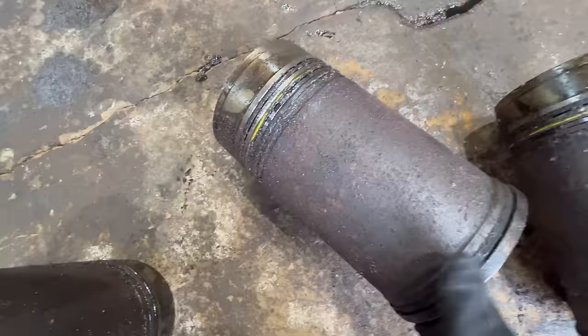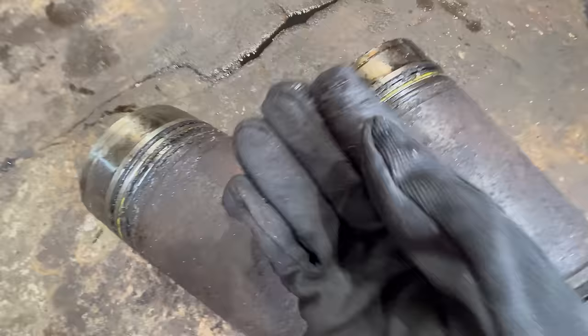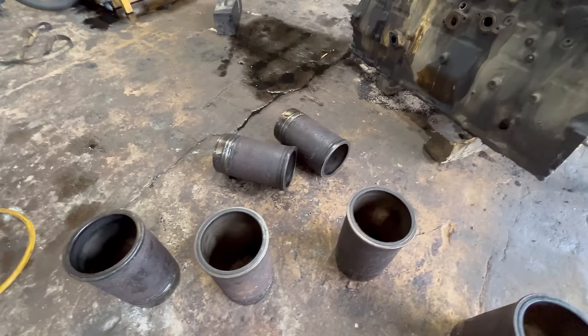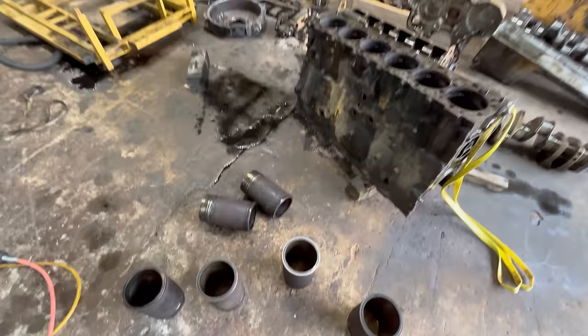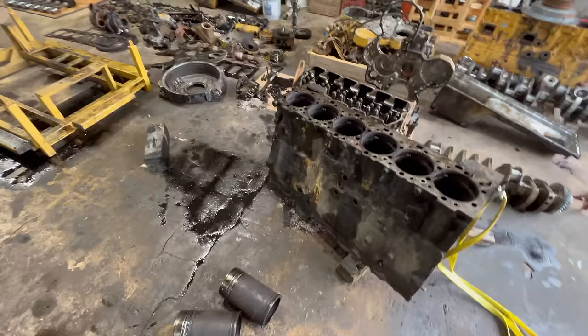I don't really understand, though, what all this material is. I mean, there's a lot of this stuff. Surely that didn't all come from these liners. I don't know. I don't know if they were running some sort of an automotive coolant that didn't have any SCAs or DCAs in it, or the way these liners look, they might have even been running straight water. I mean, this happened pretty quick because this engine didn't run long after it was rebuilt with this new stuff, so there's no telling what they did. You see all kinds of stuff. So anyway,